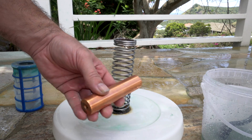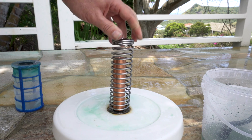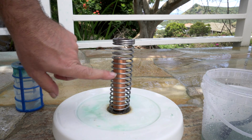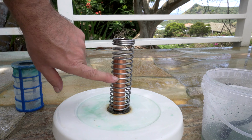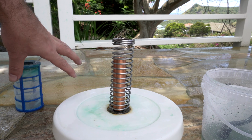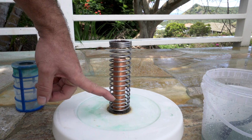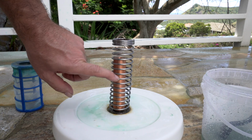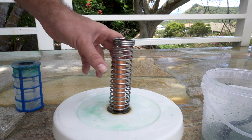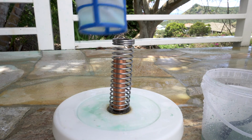So let's grab our new rod. Install it. And by the way, you can use vinegar also to rub the rod down, but the rod doesn't really matter as much. I ended up just spraying the rod with water and just leaving it the way it was, because that's not really the issue. Whatever falls off of it with water is plenty with just the jet, and it's the spring that you care about, using the vinegar on and getting that layer off. And the basket can also be sprayed, but again, doesn't really matter.